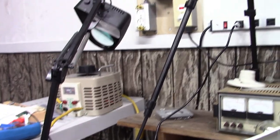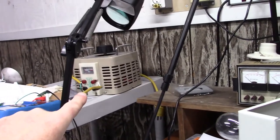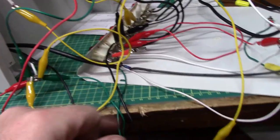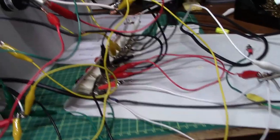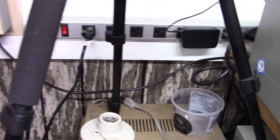The great thing to have when doing this work is everybody's favorite isolation transformer and a big variac — which I turned up to about 75 volts, just enough to turn on the light and not enough to cook myself on any of these wires hanging all over the place. Anyway, I'll turn that off and we'll set her up and get her going.